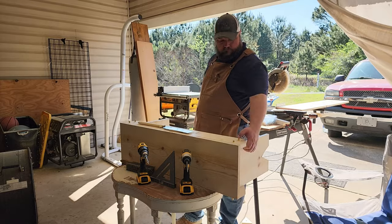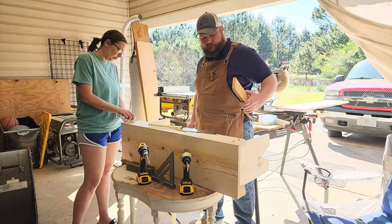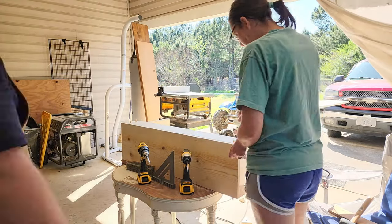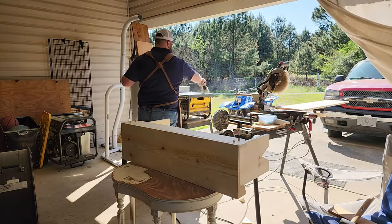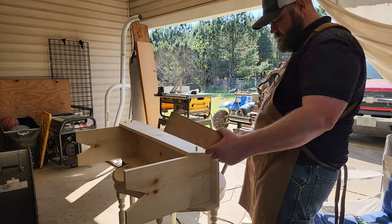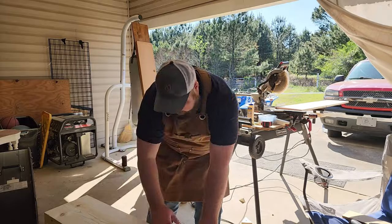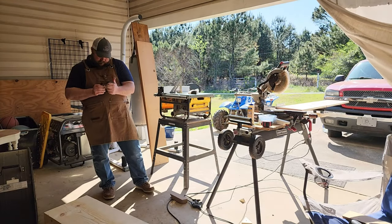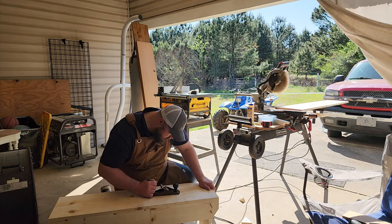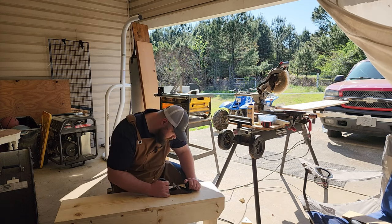Here I put the dowels in — they're shorter so it's harder to push them in with my fingers, so get a little rubber mallet and a piece of wood and just drive them in. I'll flip it over and do the same thing. Missy's wiping off the excess glue because dried glue can be rough to sand off. I'll take my bench brush and wipe off the other stuff too. Let it dry for about 10 minutes and then start cutting it off. There's an uneven part on the very top where it was rough, so I busted out a hand plane and planed that surface smooth.